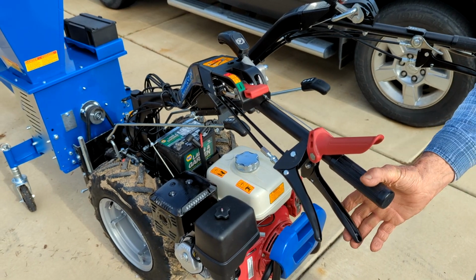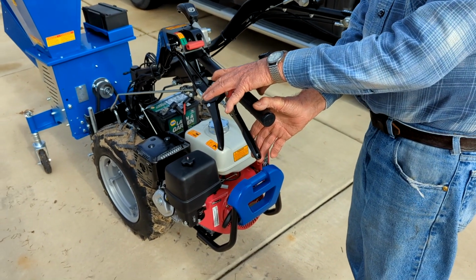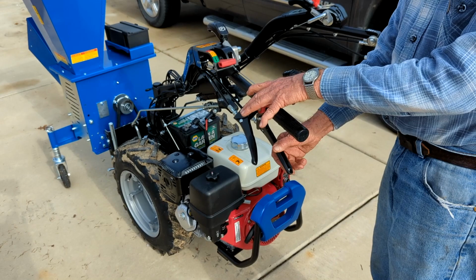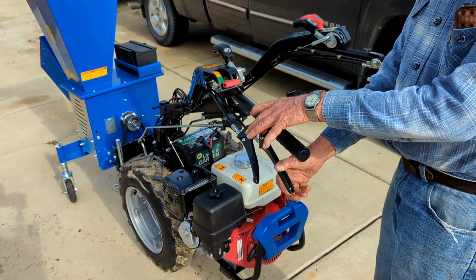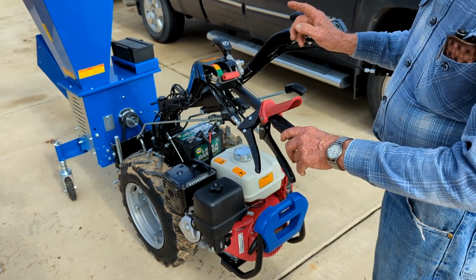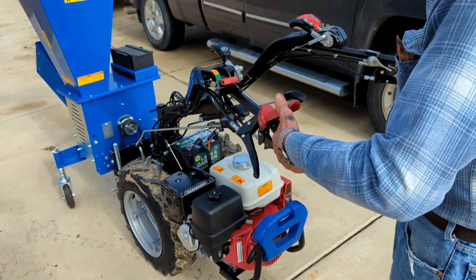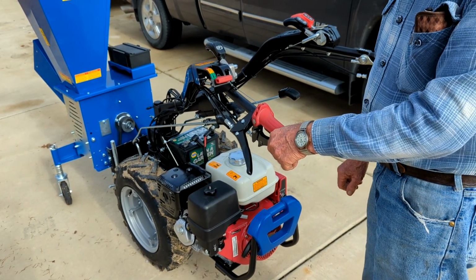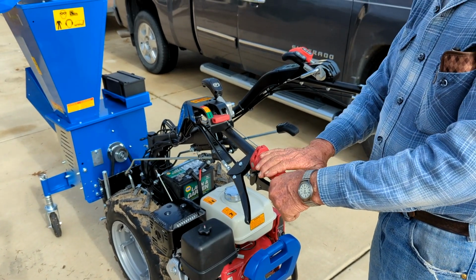All right, this is the clutch right here. This has resistance to it when the clutch is engaged. When it's down like this, the clutch is engaged, and any machine that was engaged down there as well is going to operate. But this is cutting off the hydraulic flow to the hydraulic clutch assembly down there. That's what this is doing. So you have to pull up on this and then push down on that. Don't force this, you'll break something. If you get help down there working, be sure they understand this, because this is the first thing that they're going to break right here, I guarantee you.